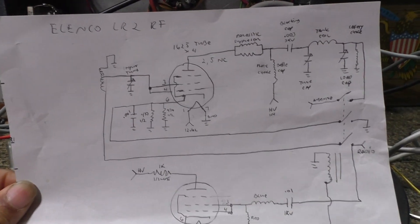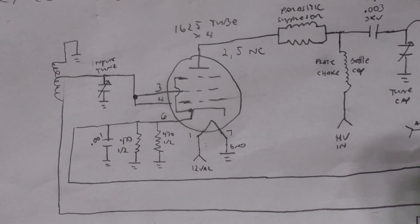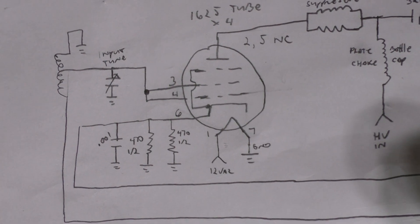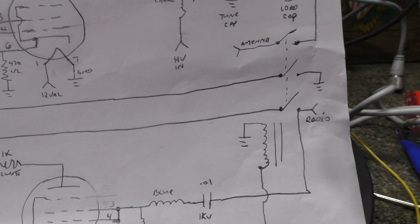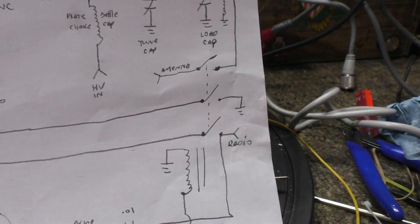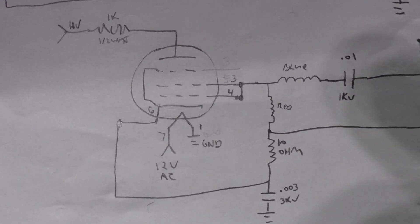For those who want to make a copy of the schematic, I'll hold it up for a minute. The only strange thing again is it drives both grid 1 and grid 2 on the input — other than that it's pretty basic. I didn't schematic out the reverse input/output crossover because that would make it confusing with wires going everywhere. That's the keying tube — not too hard.